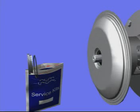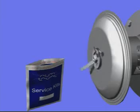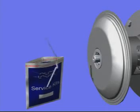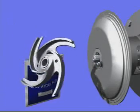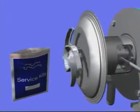Fit the o-ring on the stationary seal ring and screw it into the back plate. Always lubricate o-rings with food grade grease or oil before mounting. As for the disassembly, fix the shaft with a screwdriver.